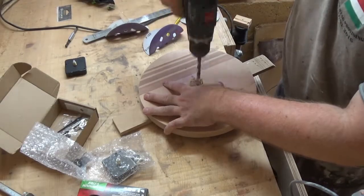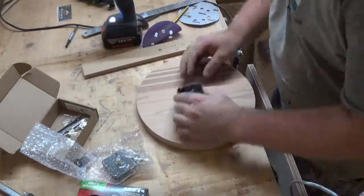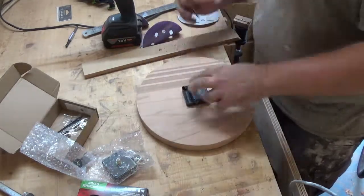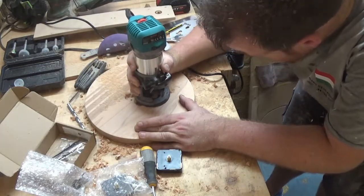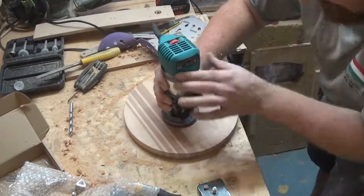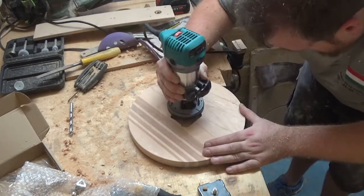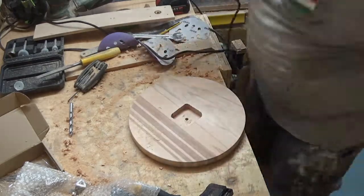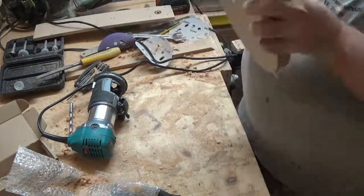To mount the mechanism to the clock face I drilled a hole that will accept the centre spigot of the mechanism, and then I'm drawing around the mechanism on the back and using a router to cut out the recess that the mechanism will sit in. Taking a couple of passes — doing this freehand, it doesn't need to be too neat because no one's going to see it against the wall, but in the end it was pretty close for freehand. If you want a really neat finish you can set up some sort of jig so that your router doesn't go outside the lines.